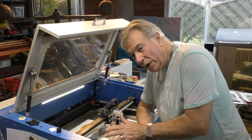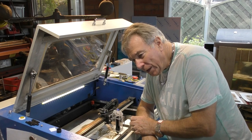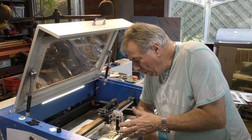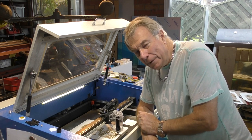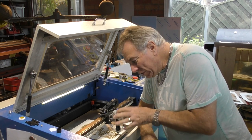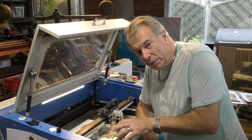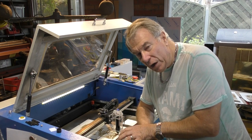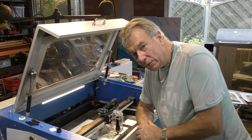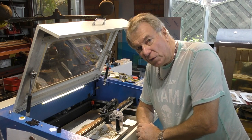But as I was talking about nozzles at the end of that program and lens tubes, there were a few sort of question marks about what the recommendations should be. And so what I'm actually going to do is to talk today about nozzles, and we're going to examine the problem we identified a couple of sessions ago, where we're not sure how much power has been absorbed by the nozzle itself, and whether or not if we open up the nozzle it will affect the cutting performance.